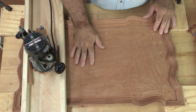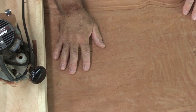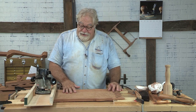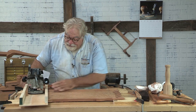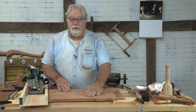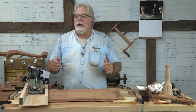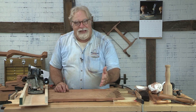One reason that I wanted to do two layers and then a skim cut is that another thing that can happen — even with straight grain wood, but certainly with wood with more figure in it — is that as you're routing away, sometimes you'll route around and leave a little island of wood. And then when you come back and hit it with the bit again, the bit will grab and throw that whole piece of wood away, and sometimes it'll pop out the stuff you want to keep as well.